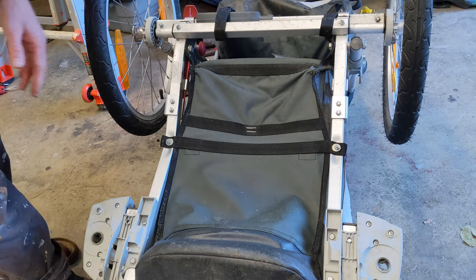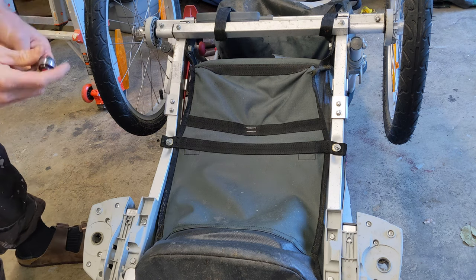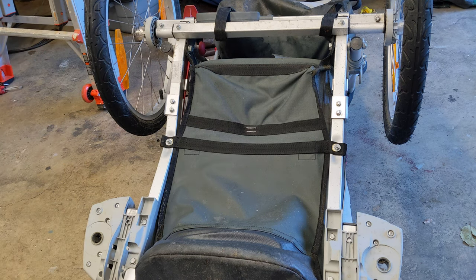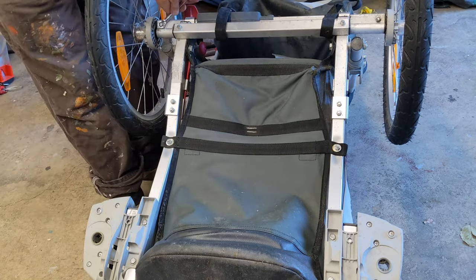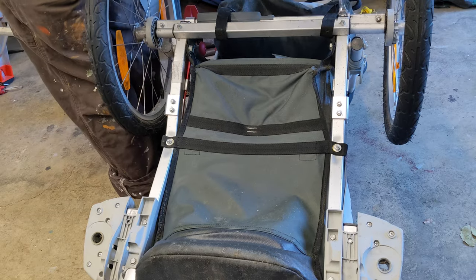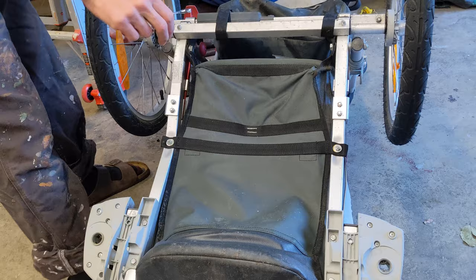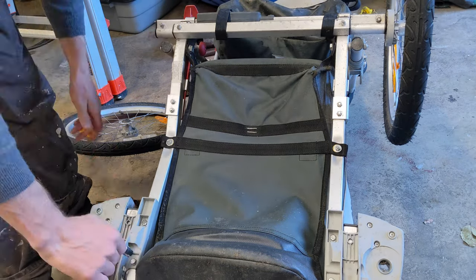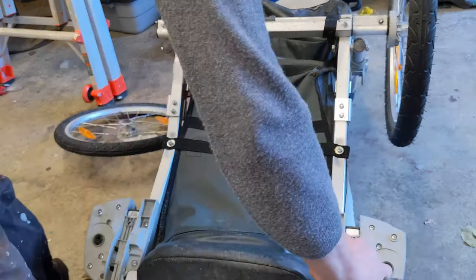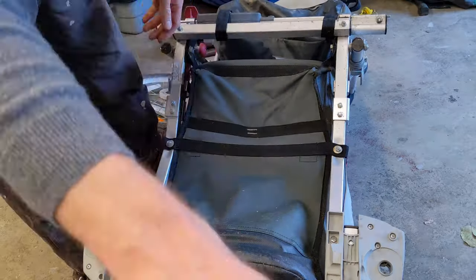Anyway, back to the tutorial. What I'm doing here is starting with a Phillips head bit, flipping the chariot upside down, and just tensioning all the screws to make sure they're snug — just touching every one. Then I get a 10 millimeter wrench and give every 10 millimeter nut a nice little turn to make sure it's snug. Then we have these four here, so we use a 10 millimeter socket to make sure they're good to go.